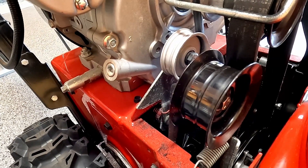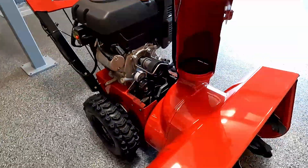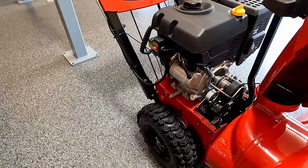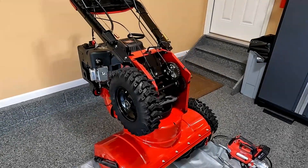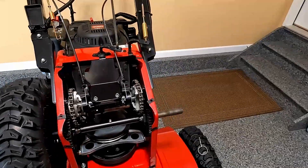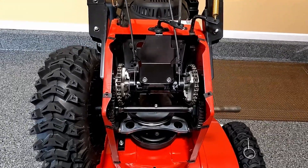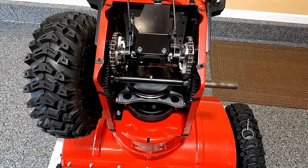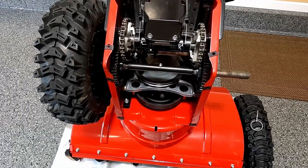Next, I'm going to put this in the service position, tilt it on the front of the housing, and show the transmission — explain how these friction disc transmissions actually work and some maintenance steps that are a good idea to cover. With the snowblower in the vertical service position, the first thing I did was drain the fuel out so there aren't any leaks. I also took the pans off the transmission — they just have simple hex bolts you can remove with a wrench or ratchet. This is more involved and not typically in the service manual, but you should do this periodically to keep the drivetrain in really good shape.